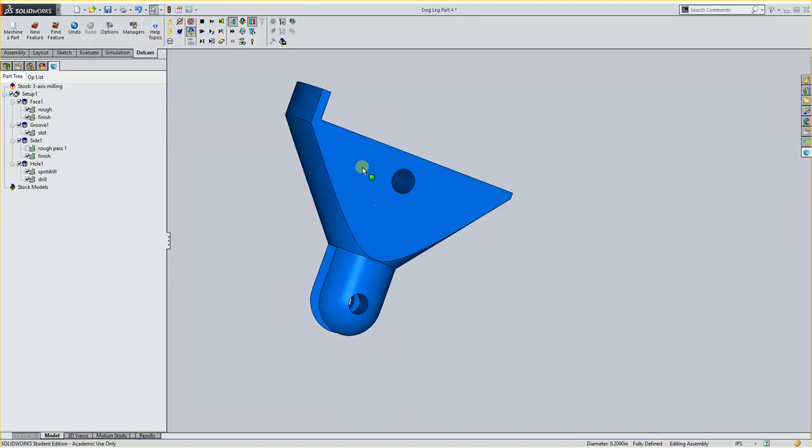Again, the way I would run this is pinch this between the vice jaws, run a parallel underneath it here because you have a flat, and then you could figure out the distance from here to up here, and you could find that information on the print. So that's it for this. This would complete this part.